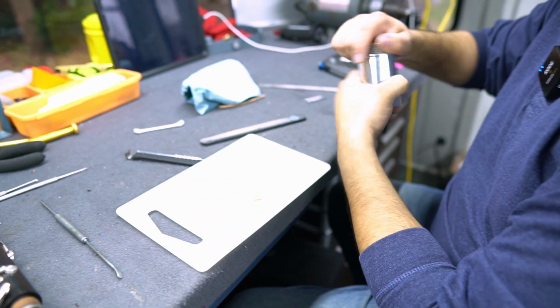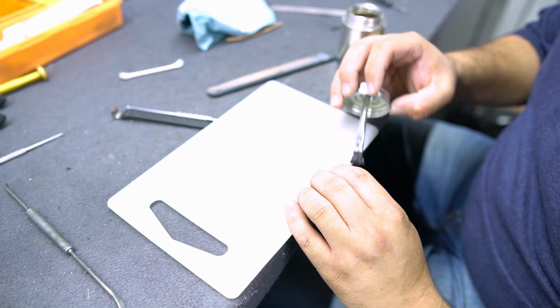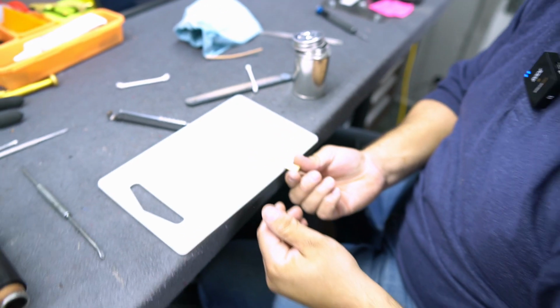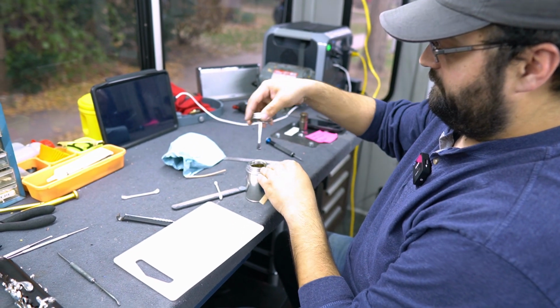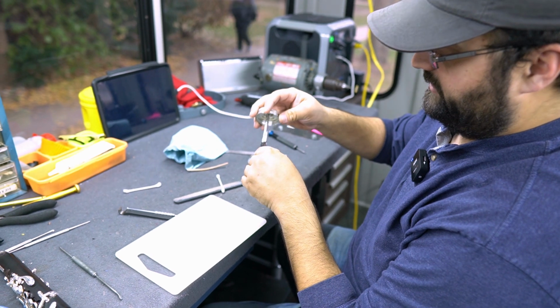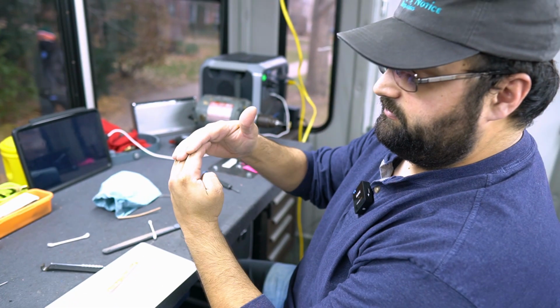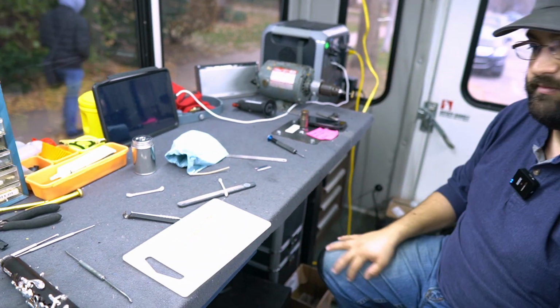So the back side is where we apply the glue, making sure to get a nice, even, thin coat. If you have too much, you'll get a glob and it won't dry properly and it could shift on us. So we do that and we do the little chamfer on the front side. So when we roll it over, it has somewhere to land on and to adhere to. And then we wait for them to dry and then we'll sand them down.